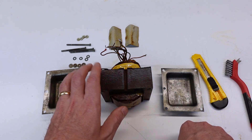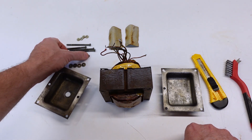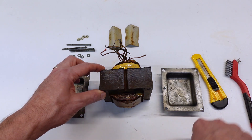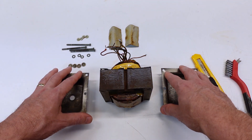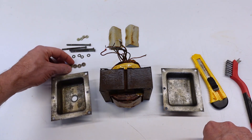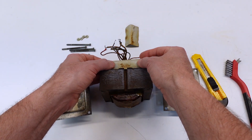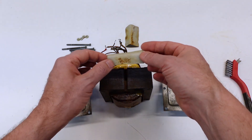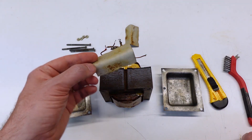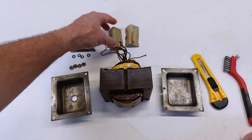I'm going to prime and paint this, which should help. The fasteners were in pretty tough shape, so those got soaked and primed — at least the tops of the screws and the washers. There are fiber washers here: when you put the bolts in to clamp the two sides of the transformer together with the outside covers, you don't want an electrical connection between one side of the stack and the other because these are effectively insulated from each other — that's why there are fiber washers. They're in a little tough shape, but I think they'll be okay. These two pieces of fish paper provide an additional layer of insulation over the windings as they come out of the transformer. There's a lot of rust stuck on there — I tried scraping off as much as I could. If I had more fish paper I'd just replace them; you could probably replace this with Nomex or Mylar nowadays. Other than looking a little cruddy, I think they'll work okay.